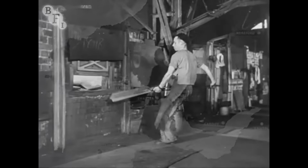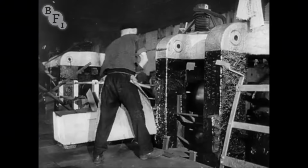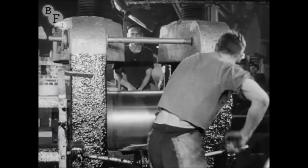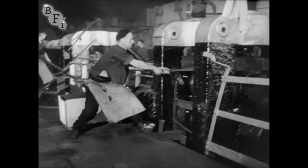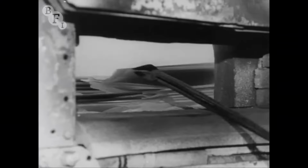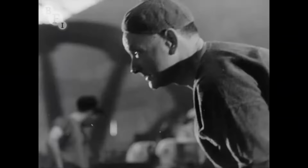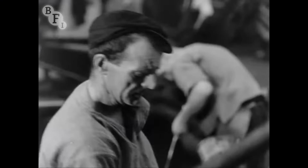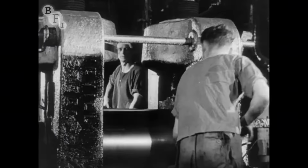For nearly 100 years, tinplate has been made like this in scores of mills in Wales. Hot from the furnace, the steel bars are rolled, and caught, and rolled, and caught, four passes in all, and returned to the furnace. Packed in the furnace, they come out to be rolled again, until doubles become fours and fours eights, and many thin sheets of steel are being rolled together.